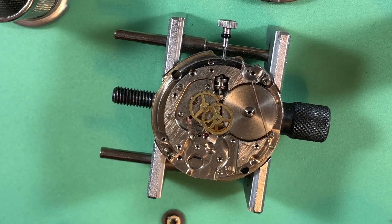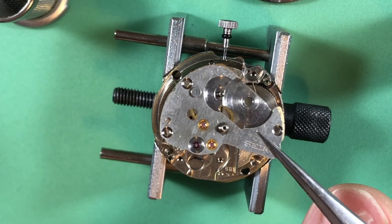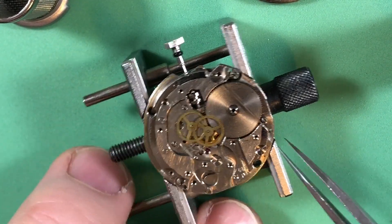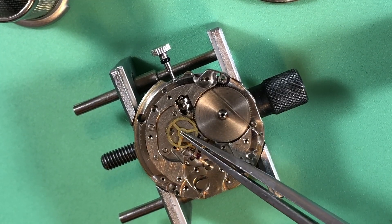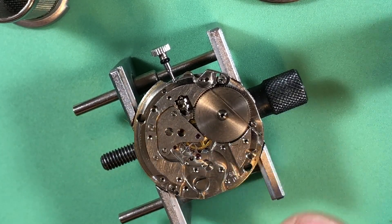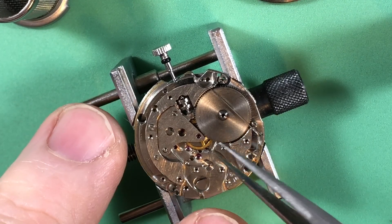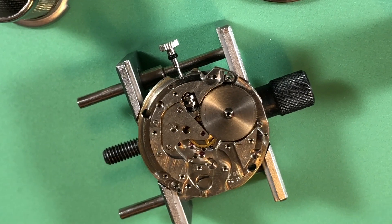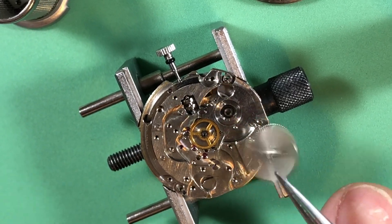First reduction wheel, however — I'll get those diafix settings out off camera because I want to make sure I'm right on top of them. Those diafix springs on these are really tiny and they tend to go kaboom and they're gone. Seiko really stepped up their game with the 7019 — vision of the future. The nice thing is these are really easy to come apart because it's just a clean design and they come apart pretty well, which is nice.